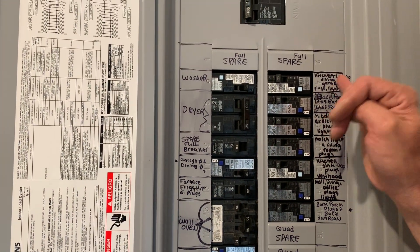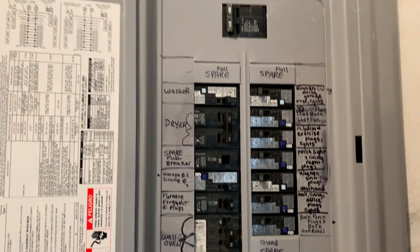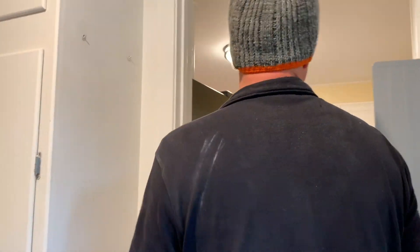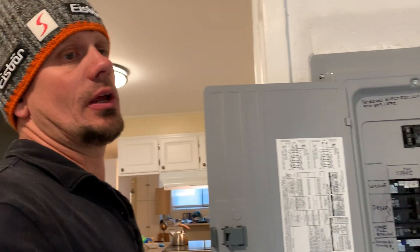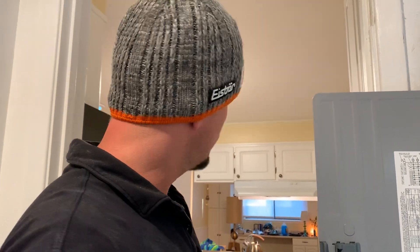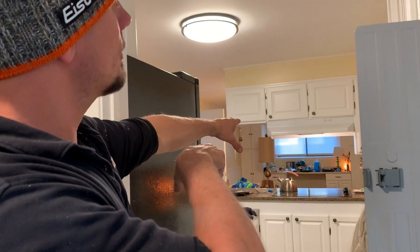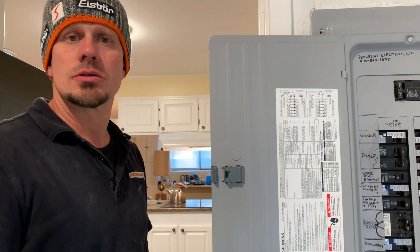Interesting how we somehow had garage lights tied to the kitchen and dining area. So when we come in to do a kitchen remodel in a year or two, we're already going to know exactly what everything is. If they go through and decide to paint the walls and take all the plates and throw them in a box, they kind of mixed up all our numbers. But at least this is labeled. Hopefully they'll gently take it off and put it right back on. These people are pretty meticulous, but they want to do a huge remodel and change the whole kitchen to the other side. When we get to that point, we're already arc faulted and dual function. As I checked the 2020 code, they still aren't going to make us arc fault the bathroom.